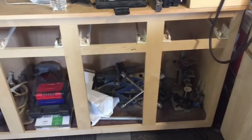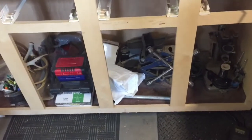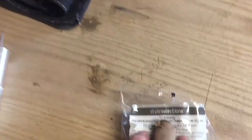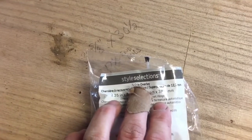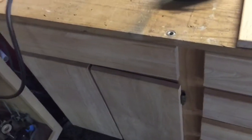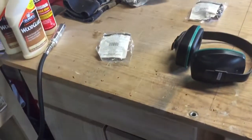The openings I'm working with are 12 inches by 21 inches, and the hinges I'm working with have a half-inch overlay. So essentially I need to make my doors 13 inches by 22 inches, and that'll give me a half-inch overlay around the entire door so everything is covered.